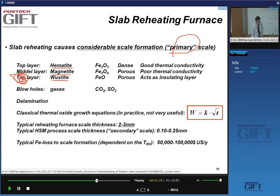This is a very dense layer, and it has good thermal conductivity. This is a porous layer and has poor thermal conductivity, and FeO is also porous and is very insulating. So these oxides will have an impact on heat transfer and therefore on the cooling of your slab. There are also some holes in these oxides, which are usually CO2 or SO2,